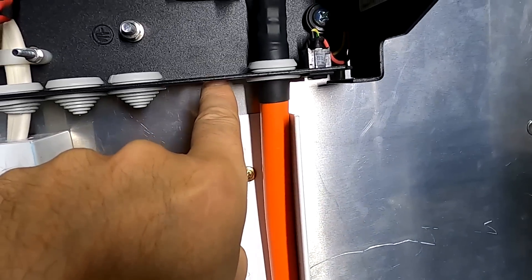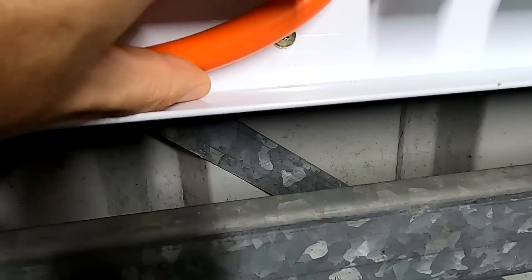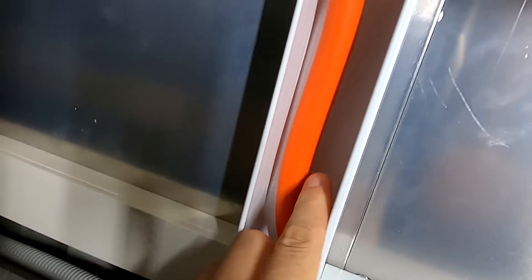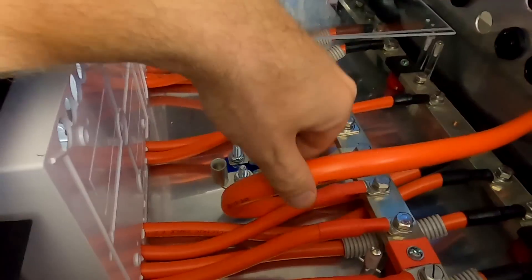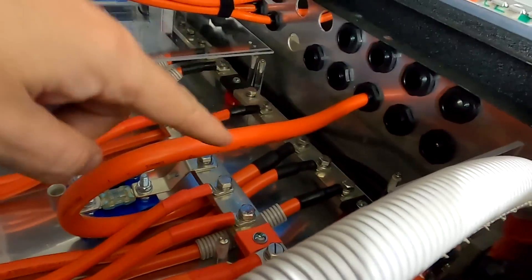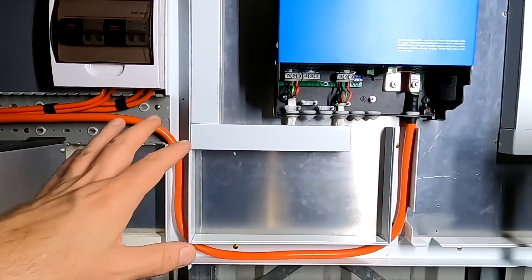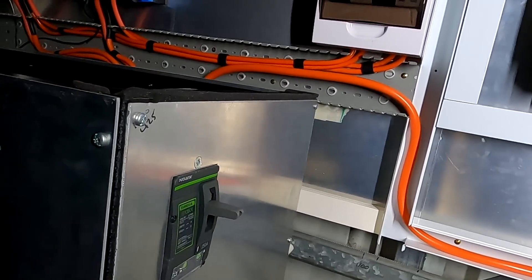The positive will jump over here because it needs to go to the positive terminal anyway. Down here I need to push this one up as far as possible. It's going to be very tight at these 90-degree bends, but we've got enough slack and plenty of cable left to push back and forth and adjust the length through the corners — which was one of the reasons to go with Option A. We've officially connected the battery negative to the inverter terminal — and it was easy.